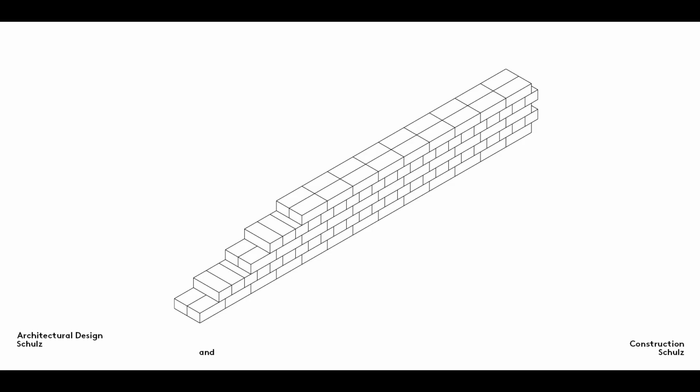The stability of a wall depends not only on the force-fit connection between the individual bricks, but also on the thickness of the wall and the pattern in which the courses of bricks are arranged. This pattern prevents the formation of long vertical joints along which a wall might crack and eventually break apart. This geometrical pattern of bricks is called the bond.